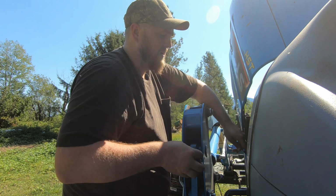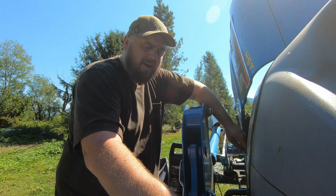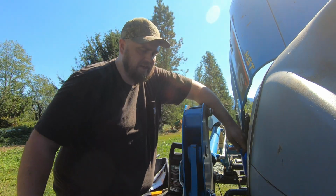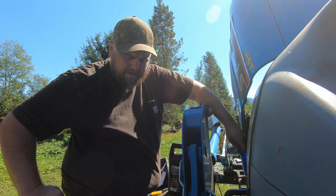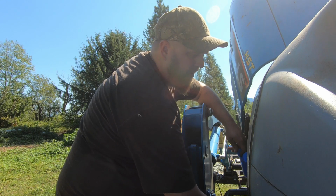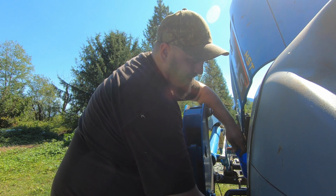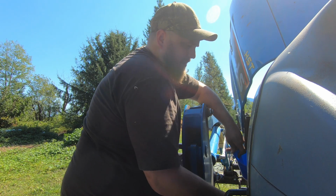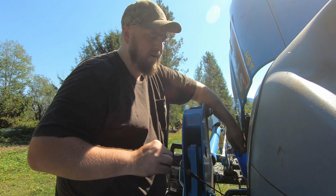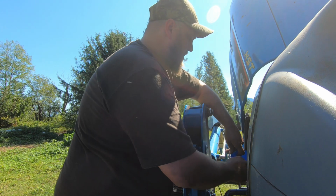And so what I did was I was using dyed fuel, like the off-road diesel that all the cool guys tell you to use. And don't do that. I switched to on-highway fuel, and even though it's a little bit more money out here, I seem to be getting better fuel economy, and I'm getting regens every like 30 hours instead of every 10. Okay, almost there. I think we need 0.6 more gallons.